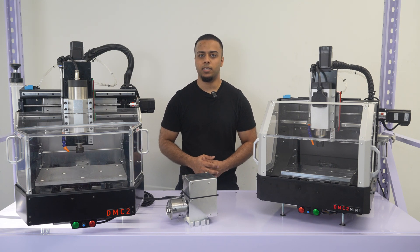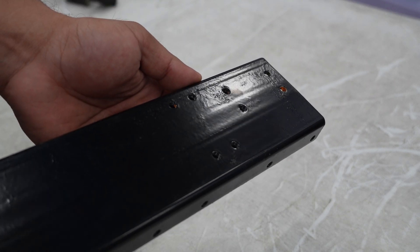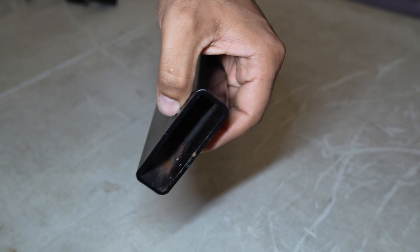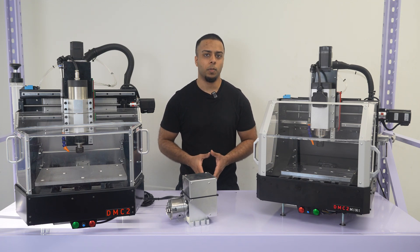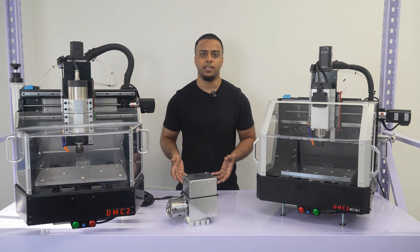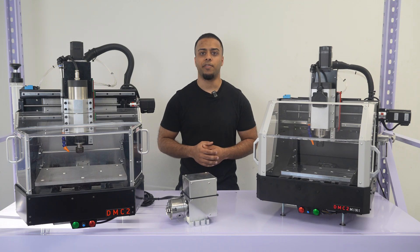The last thing I dislike about the DMC2 is the quality of the metal. On some of our parts there are ugly burrs, inconsistent powder coating, bumps under the powder coat, and sometimes even rust inside the tubes. It didn't look premium on maybe 10 to 20 percent of all of the parts. Most of this was aesthetic and did not affect the final machine performance at all, but understandably people were not thrilled when opening a box and the first thing they see is a poor paint job on their brand new parts. What happened is that we did a test batch of 10 units with our manufacturer before launching on Kickstarter — the parts came back excellent, everything looked great, so we went ahead and launched.